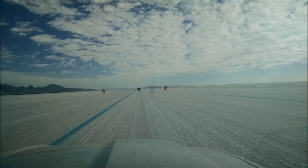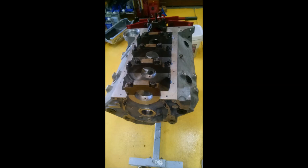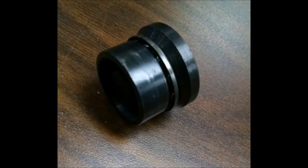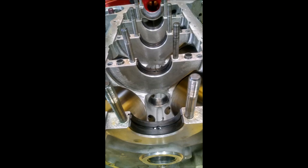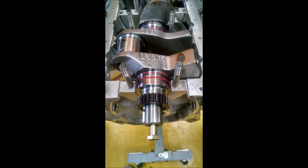This is what the course looks like at Bonneville. I stalled the engine and then ran it through first gear — it was running rough, shifted to second, started misfiring, and the power went away. My slip showed 65 miles an hour. Time to go back and tear things down, which I did. Tearing the engine block down, I found I had made a couple of rookie mistakes. The worst was that I had forgotten the cam button, so the cam was running back and forth and retarding the timing. I had a chance to put in some new bearings — brand new King main bearings with a special coating.